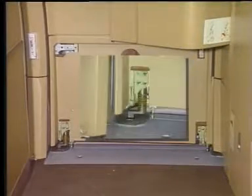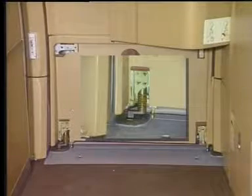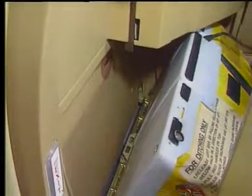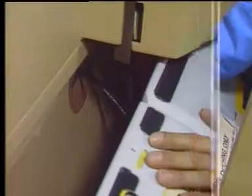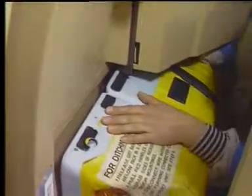Lift the slide raft pack assembly onto the passenger crew door supports. Carefully move the pack board assembly inboard at an angle onto its supports and hold it. Connect the pack assembly connector to the electrical connector on the passenger crew door. Move the pack assembly in position and install the stud assemblies in the door attach anchor nuts.